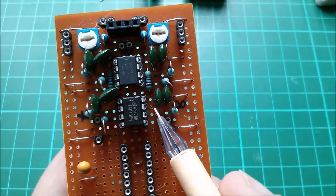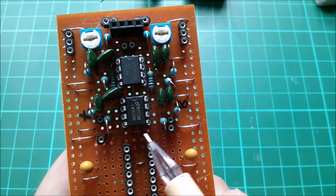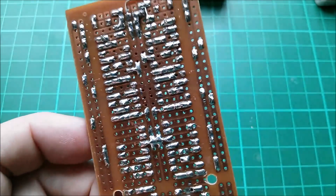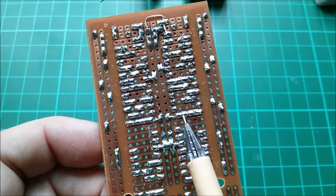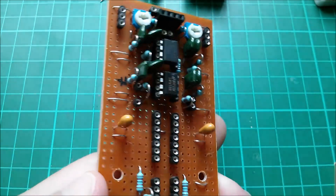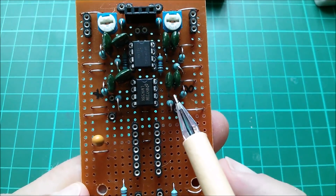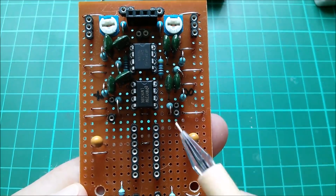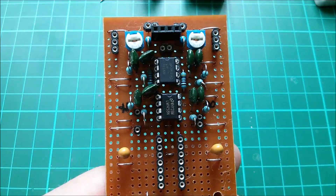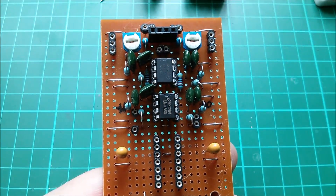Now I've got a problem. The holes — pin seven there and ground, pin one there and ground — they're all full of solder from where I pulled them through. Now I could suck or wick solder off the back here, but then that's going to suck it off components as well. I think it's probably easier just to poke a bit of wire in there, heat it up from the bottom, and just dab the wire in and out to work a new hole through there. I'll use that technique I think.